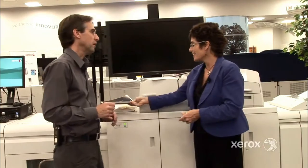The third option is a very Xerox-unique thing. Our perfect binder, although it is inline with the color press, also comes with a manual mode. This means customers can use it not only as a perfect binder for content they're printing on the color press, but also as a perfect binder for their entire print shop — so operators from other devices, monochrome, highlight color, offset presses, can bring their output to the binder and share the workload. You can imagine 80 to 100 pages a minute coming in from different departments and machines, manually dropping them in and creating perfect bound books while the machine is running. You can continue to operate the color press and fully utilize this asset by getting other volume through it from other devices. That's a very big deal.